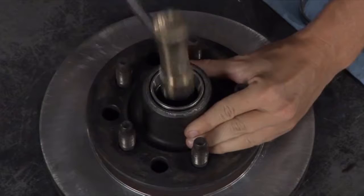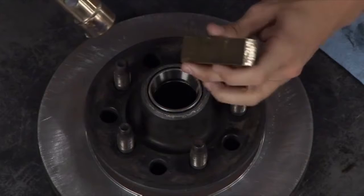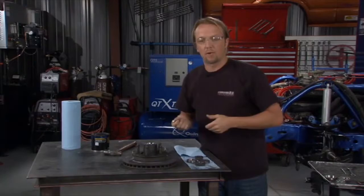With the hammer, I can get it down to where it's level, but I've got to get it all the way down to where it seats. So I'll take this little brass block, get it lined up on the corner, and pound it down until it's into place. That's going to take a couple of minutes, so I'll keep working on that. When we come back, I need to grease up the bearings and Bruno has some work to do as well.